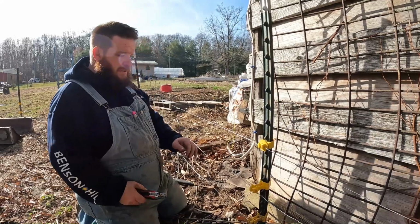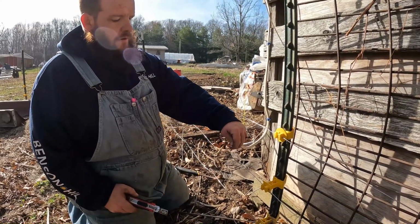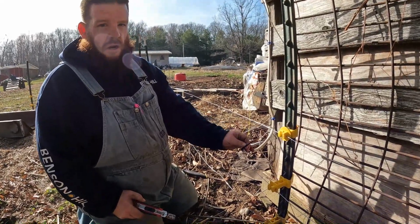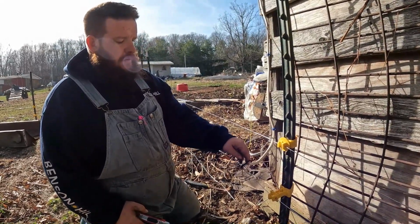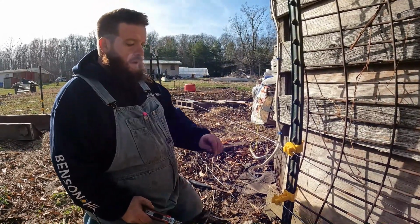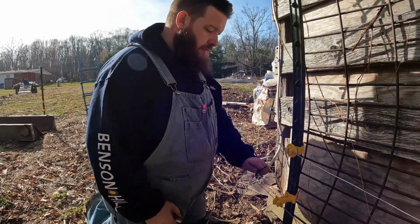You see me look up there. I was just making sure you got three wires in here. You got a power, neutral, and your ground. And over there, we use the bare wire for the ground when we hook the ground system up. Now we're going to use the black as our hot. And we'll bring it in here, tie it to this wire here. That will make this wire hot. And then we'll run a jumper wire from here to, we'll tie all three strands together. But I looked up at the charger to make sure I use the black up there, because if you used the white up there and put the black here, you wouldn't get nothing. So I was just double checking myself.